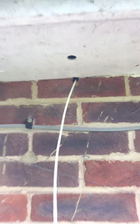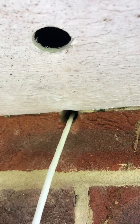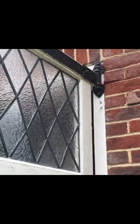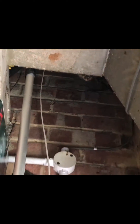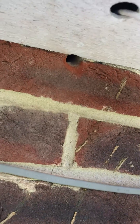The first step, as you can see, was to draw a wire because although these cameras are Wi-Fi they are still powered by a 12 volt power supply, but we've used one cable to power all three of those cameras. We drilled through and just behind this actual soffit board is a garage which had a mains power source, and that's what we're going to use for the three cameras. It's worthwhile noting that each installation differs and in this particular installation the house is actually particularly old, and we had found that just behind the soffit board was some asbestos, which is going to dictate some of the wiring things we've done which you'll see in the follow-up.